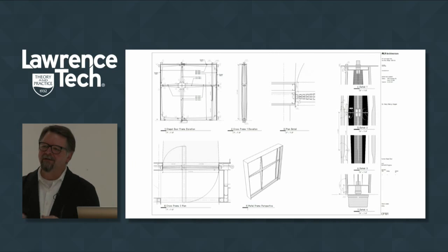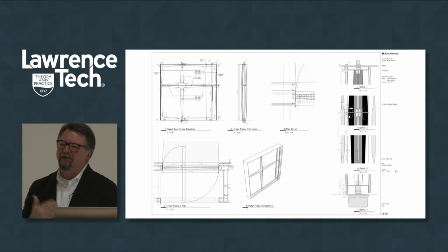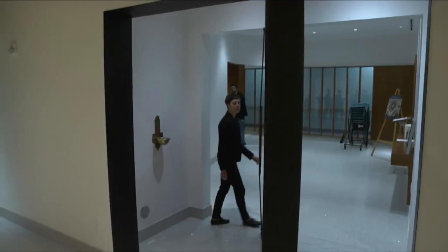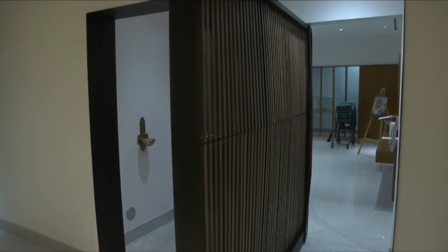Interior swinging doors to meet ADA accessibility need to operate with no more than 5 pounds of force. We had found the hinge manufacturer who decided they couldn't guarantee that it was going to move with that force, given the weight of the door and the strange design, which they couldn't quite calibrate. We went around and around, and then finally found a loophole. It's a rotating door, not a standard pivoting, swinging interior door. It has a closer built into the hinge.